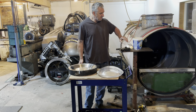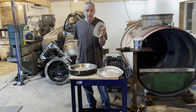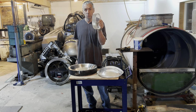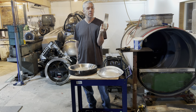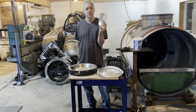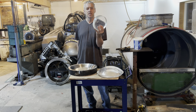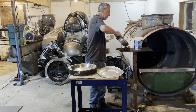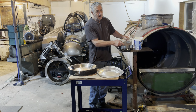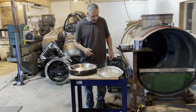This window is 1.5 inches thick — it doesn't need to be nearly that thick, that's just really overkill. But this is a non-annealed window and that's why I went oversized. This is just a straight window from Reynolds Polymer cast acrylic, and because I didn't do an annealing cycle on it I just oversized it. I've actually tested these already to 400 feet and they were perfectly fine.